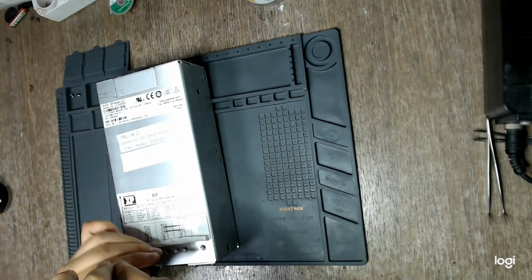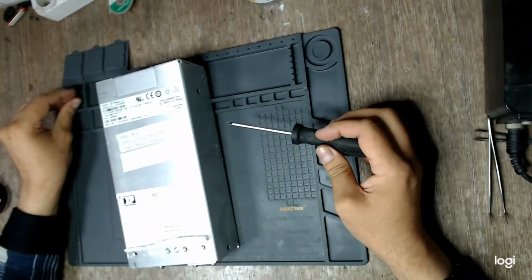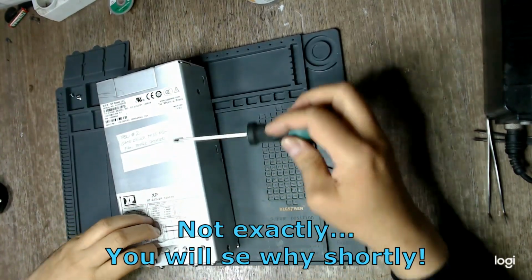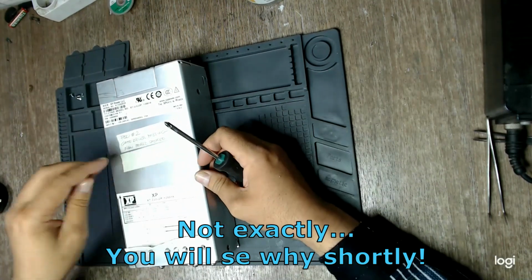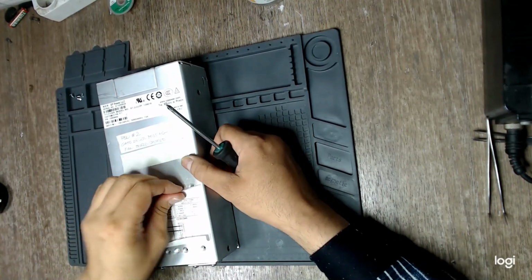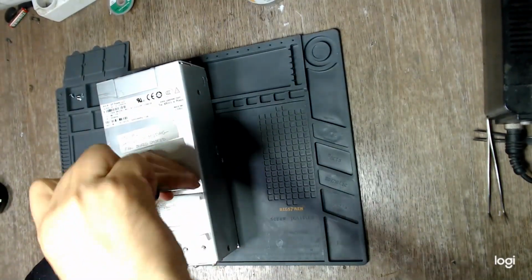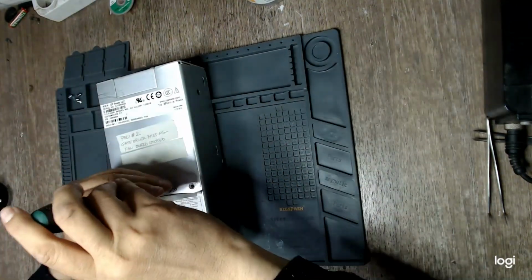From what I have seen in Tony's video, it seems like a MOSFET gave out, and looking at the working board from the first power supply, it is a P-channel MOSFET on the output to the fan. Why would that fail? I am not sure, because the fan that Tony tested the board with was working.